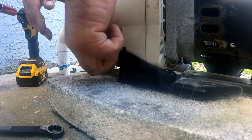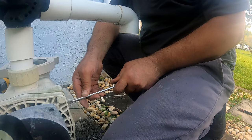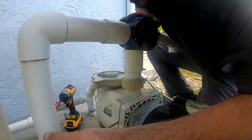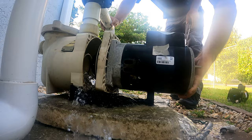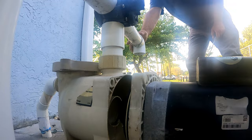There are four bolts holding the pump cover — two on top and two on the bottom. Using a flat screwdriver, carefully separate the cover from the pump just about 1/16th of an inch. There's a rubber seal around the inside that can get damaged if the screwdriver goes too deep. Then slowly shake the motor loose and let the water in the pump drain out.